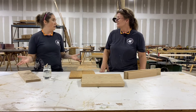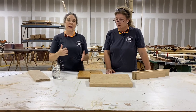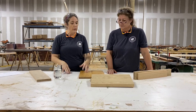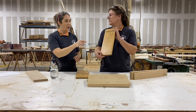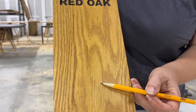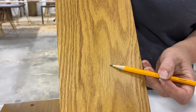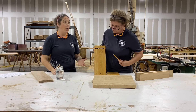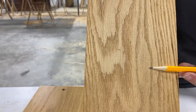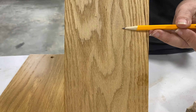One of the things I've learned is that the way you can tell the difference between red oak and white oak is to look at the grain pattern on the face of a board. Red oak has small little flecks called rays — very tiny, usually no more than three-quarters of an inch but typically around an eighth of an inch. Red oak also tends to have a busier grain pattern with a lot of cathedral figure. White oak, on the other hand, has longer rays starting at about an inch and getting longer, and the grain pattern is a little quieter and more muted. That's one of the key ways you can tell the difference between red oak and white oak.